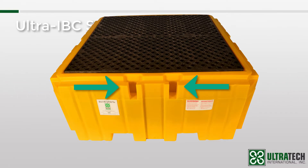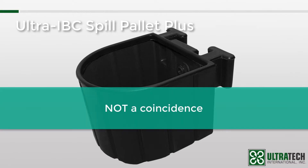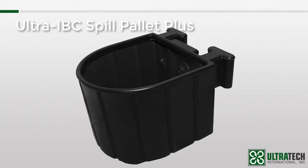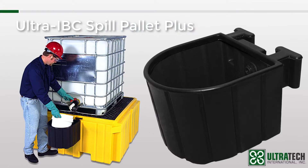Now some of you may have noticed these slots in the front of the pallet and wondered what those are for. Well, my friend, later is now. Those slots are part of the IBC Spill Pallet Plus mold and are put there for an accessory item we call the bucket shelf. The bucket shelf has a five-gallon capacity and is large enough to hold a five-gallon bucket — it's the perfect addition if you're dispensing from the IBC into buckets or smaller containers. If you order a bucket shelf and an IBC Spill Pallet, the factory will drill a hole through the bucket shelf and a matching hole through the sidewall of the pallet. We'll include a bulkhead fitting, and once installed, any spilled liquid past a certain point in the bucket shelf will flow into the spill pallet sump. So if the spout on the IBC is left open, everything will be contained.